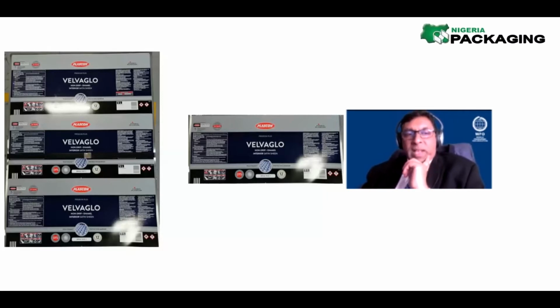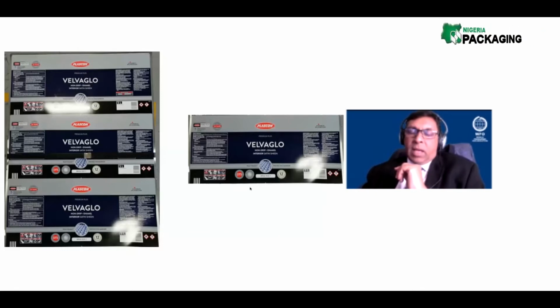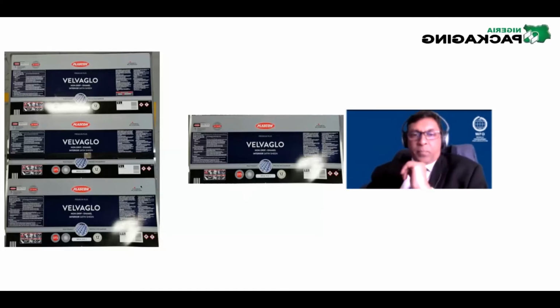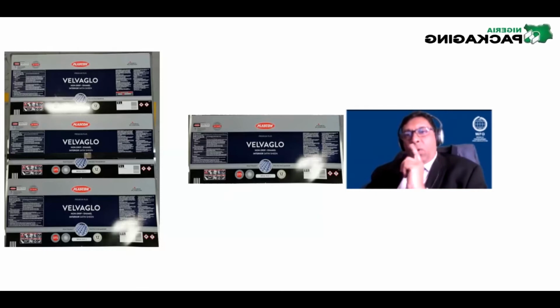Now, once these are cut in the middle, they cut apart, you will end up with one Velvet Glow can blank like this. We call them a blank. In the industry, it's called a blank, B-L-A-N-K. This blank is then folded over or rolled over, and it is side welded here. You can see my cursor. It's side welded here along this line.